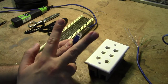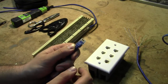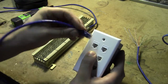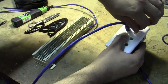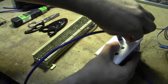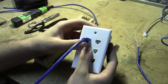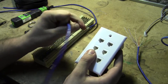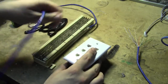Ethernet and fast Ethernet use the second and third pair. The original conception was that on one RJ45 jack you could either wire it up for Ethernet, or you could also plug in a standard RJ11 telephone jack, which taps into the center pair. What I'm doing is taking advantage of the fact that Cat5 cable happens to have four twisted pairs in it, which gives us four telephone lines.